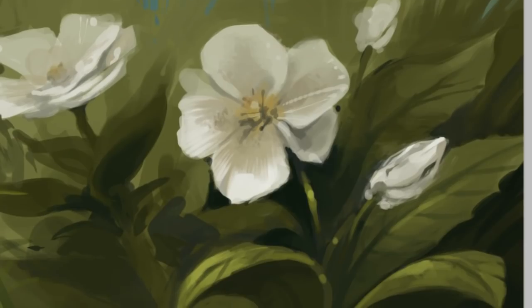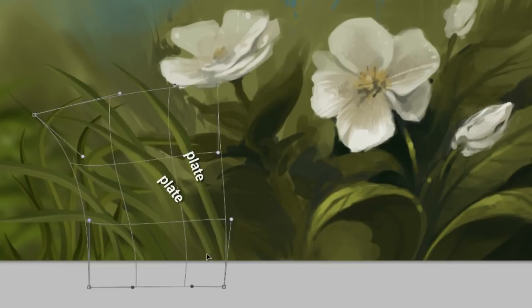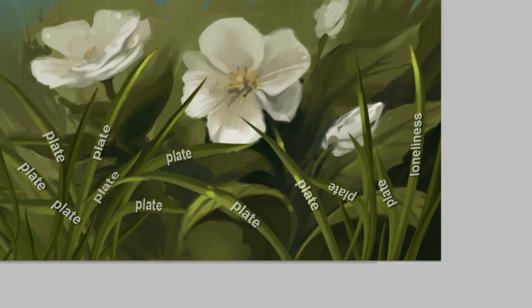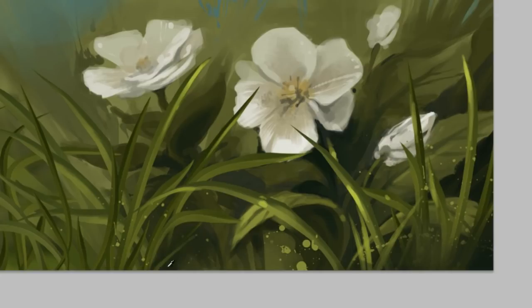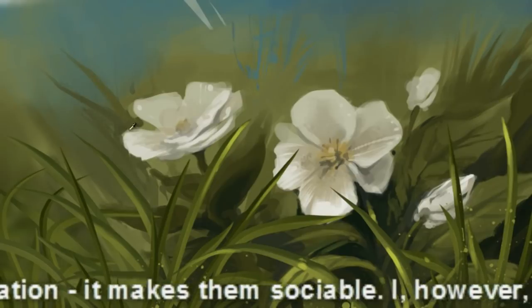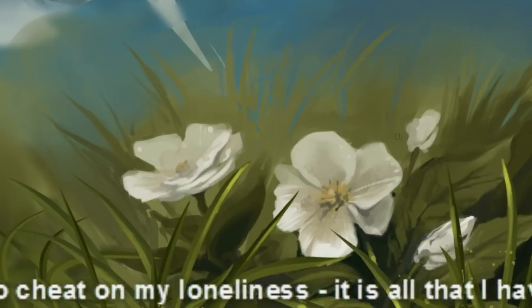Graphic artists adapt hand drawings of the face cards, adding color and a touch of regal class wherever needed. The next step is to make the printing plates. A computer-guided laser etches the design into the polymer surface of the printing plate. Entirely automated, this machine produces 30 plates an hour. To set up for a print run, workers pour several cans of thick cyan ink into the ink duct — the three other colors receive the same setup. When the printing press gets rolling, each fountain will disperse ink evenly via 16 rollers.